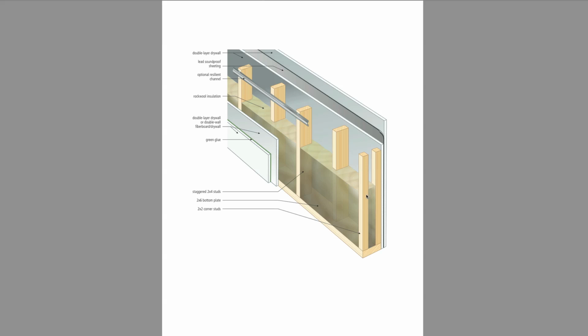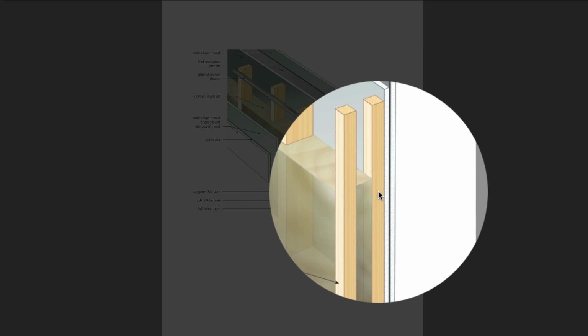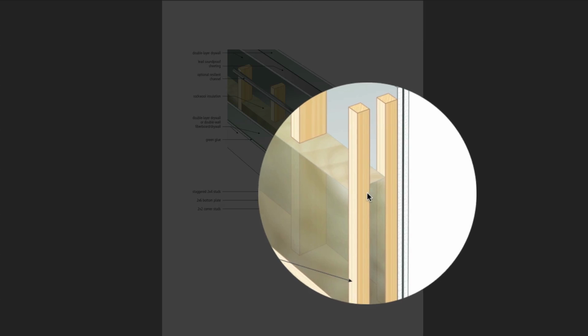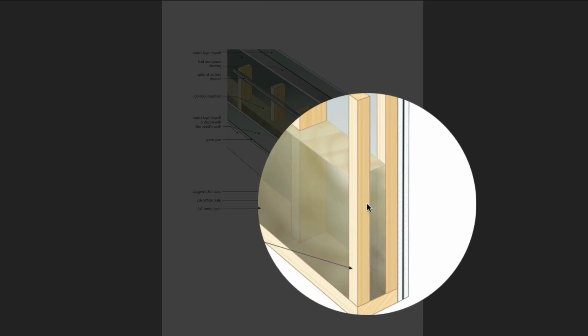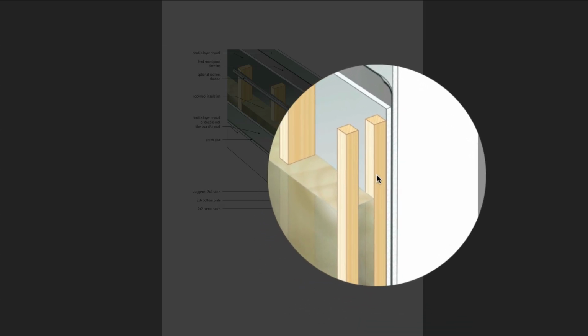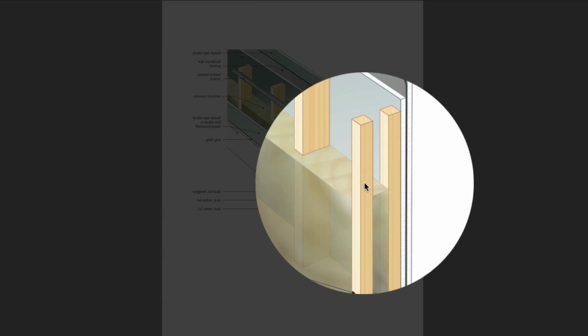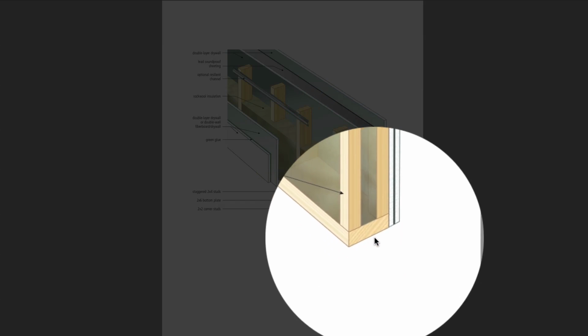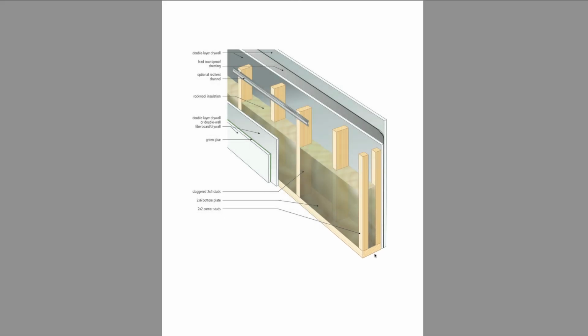Now, just one last thing before I finish up. This is a double stud here, in a sense. They're small. The idea is that the wood is not continuous all the way through. We couldn't stagger it here because it's right on the end of a wall. So breaking up the studs in two halves like this makes sense. Now, it's not a big deal, though, because in all likelihood there's going to be a doorway here, and that will let a fair amount of sound through, both around the door and through the door. Doors aren't all that thick, and they don't have all these features built into them, but this is generally considered the ultimate way of doing the end of a wall where you can't stagger the studs.